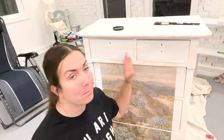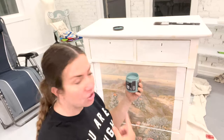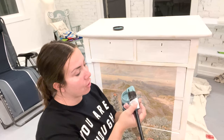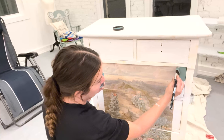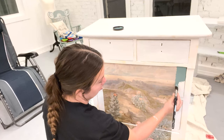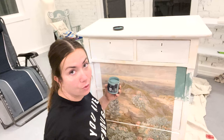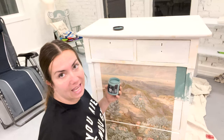The next step is painting this dresser. I'm using DIY Farm Fresh because it matches a lot of the shades in the succulents. I'm just going to use the same paint brush I used for the primer — I just washed it. You can pick up this paint and all these products at jamierayvintage.com. I'm going to come along the edge and feather in the Farm Fresh, then brush it and feather it in. It'll take a few coats to get perfect coverage, but it's going to look really good. Then I'll come through and white wax everything and it'll all mesh well.